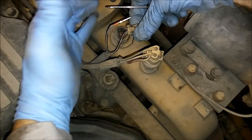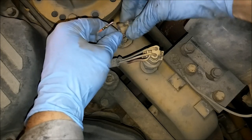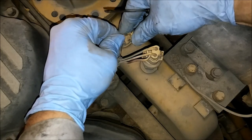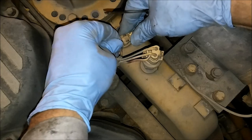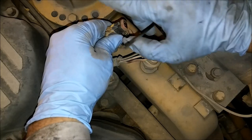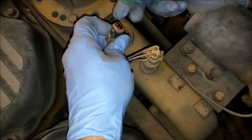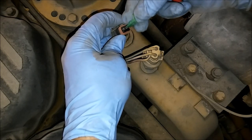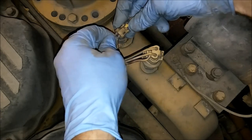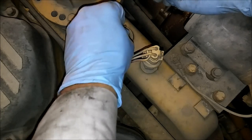Now your socket is removed. If you're going to repair the wiring or run a new wire from the ECM, that is how you remove it from the sensor connectors — they're fairly all the same. The AmpSeal ones with the little red tang on the outside, you have to move that before disconnecting the connector from the sensor. They use the same style. After you reinsert it, make sure you put that retaining cap in. What that retaining cap does is it keeps the lock tangs in place so that the pin cannot get pulled out, or else you get a check engine light.